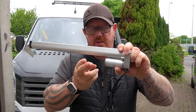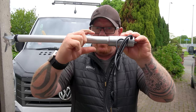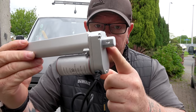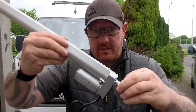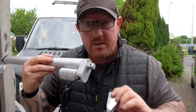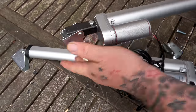You've probably noticed the motor sits underneath. I want the motor to sit sideways - it still does the same thing, but if you put it on the side you've got less gap underneath the solar panels and you don't have to raise them as much. The problem is the end of the actual motor has a collar with a split pin that allows it to tilt up. Because we want them sideways we can't put that on as it'll snap. So I've made this little piece - just a piece of box section with holes in the top and holes in the sides - so we can mount this onto the side and make the actual motor go sideways.